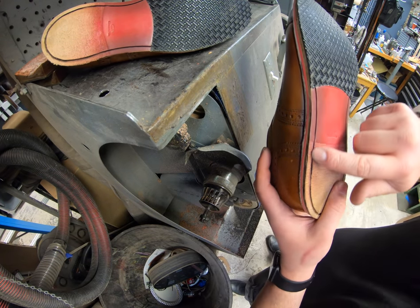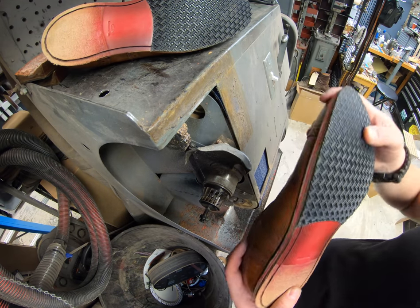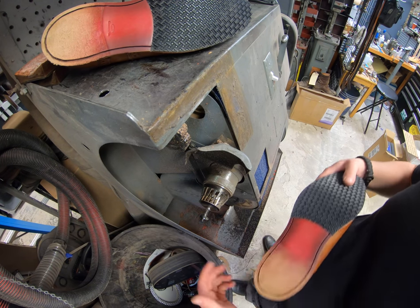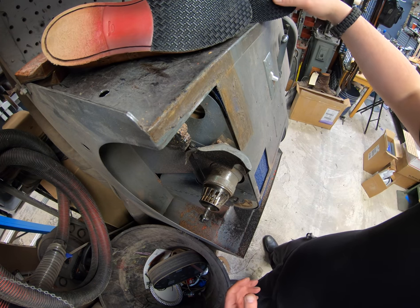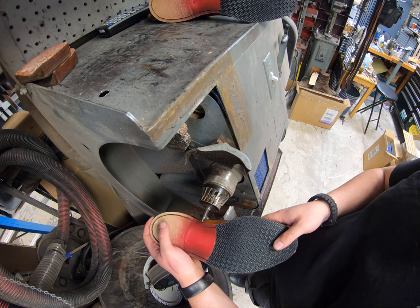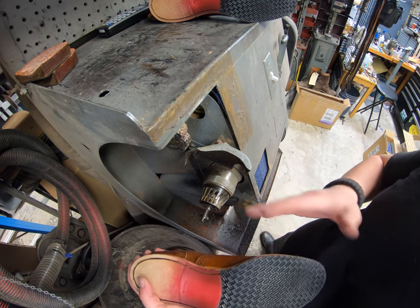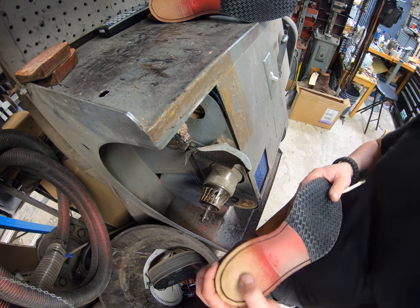Since we already did the channeling up here, now we want to go ahead and channel the rubber half sole on here a little bit. And we're over at our channeling machine, which I need to readjust. I just used it for something else, so I've got to readjust the depth on it just a little bit, and be right back. All right, got it readjusted to the proper depth. We have this stopper right here, which kind of prevents it from sliding off or anything, and gets us the proper depth that we need on these.